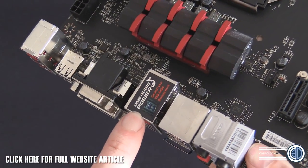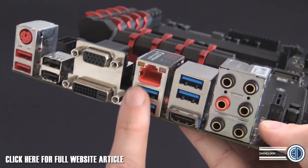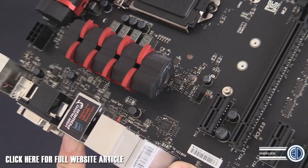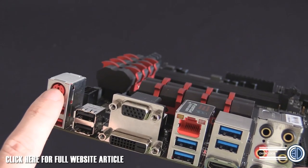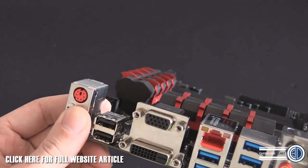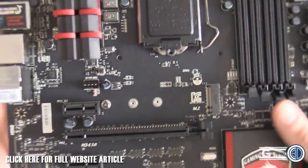Around the back there's a sticker on the top - USB audio power - and you can stick that on. I don't know whether it means it's just on these slots or spread across - I'm waiting for clarification from MSI about that. You can see the gold-plated audio jacks here. We've got four USB 3s, HDMI, and that's a Killer Ethernet as well - it's Killer networking. DVI, D-Sub, then USB, USB - these are both USB 2, and then we've got the PS2 port. These are red because it's technically their gaming bit - where you should put your keyboard and mouse. But these are still really, really handy. I'm so happy on some boards when I see we've still got USB 2s and PS2s, especially when you start to overclock.